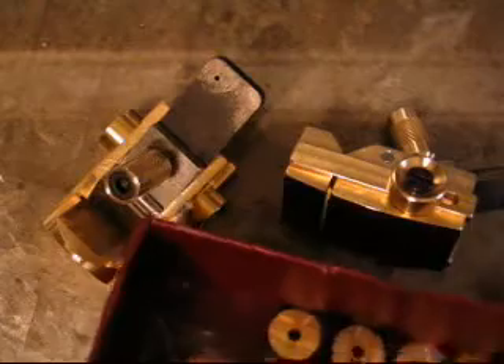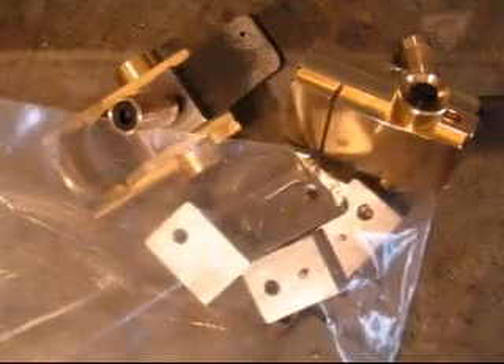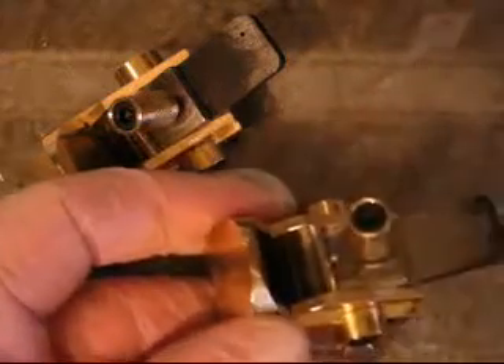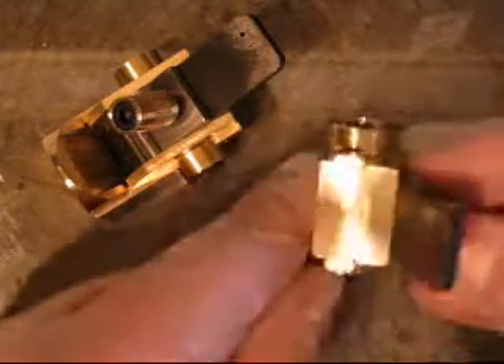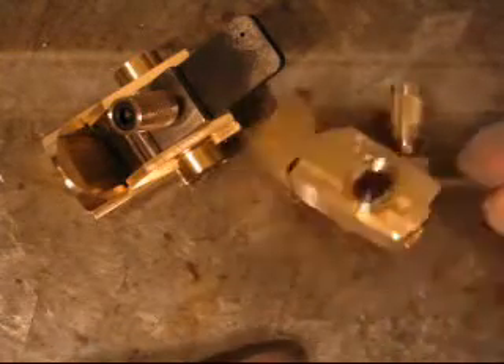There are other bits and pieces in the box — other little knobs and parts ready to assemble the rest. We've got a bag full of cap irons. The clever thing about the cap iron is that when you take it out, it's got a small brass pin, which means it can only go so far down into the mouth or frog. Every time you slide it in, there's just a little bit of clearance — I think about two thou. Give it a quick tighten and that'll resist all the pressure you need and hold it securely. They're all stamped with my name on the back — that oval stamp, which we used to use on the reels. Quite pleased with how it's all worked out.